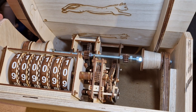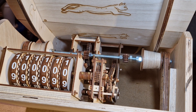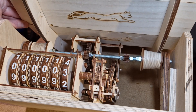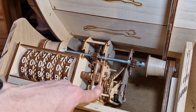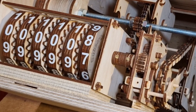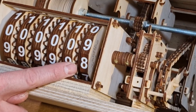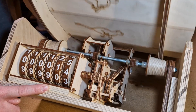I'm quite happy with how the calculations worked out. The distance on the inner diameter is pi — approximately 3 meters traveled on the inner diameter per full wheel rotation. So if we return to exactly the same position, the last disc should advance by three. And it does — just over three, reading 3.1. When going in reverse, the mechanism ensures the count still goes up, not down. There is a bit of play — you lose about three meters each time for the mechanism to re-engage — but then it starts moving and still counts up as the wheel reverses.